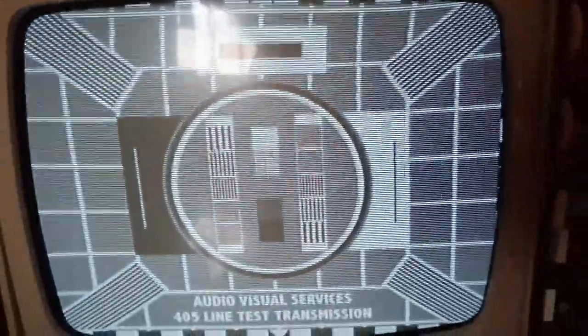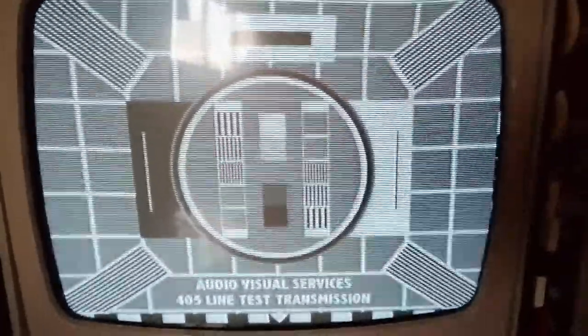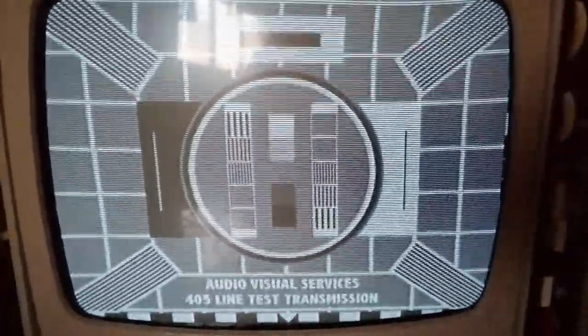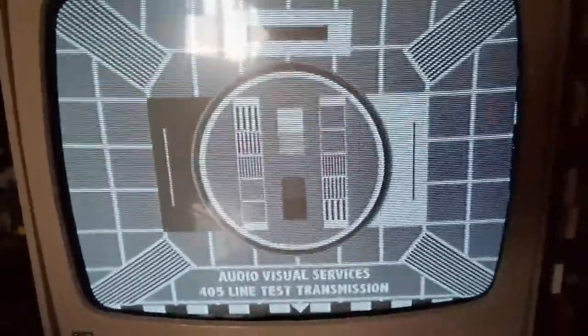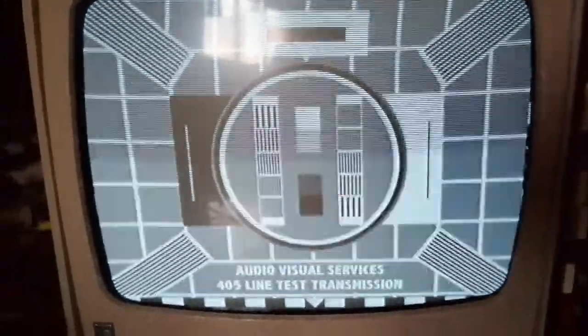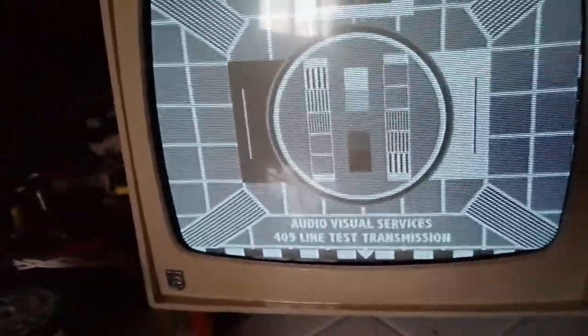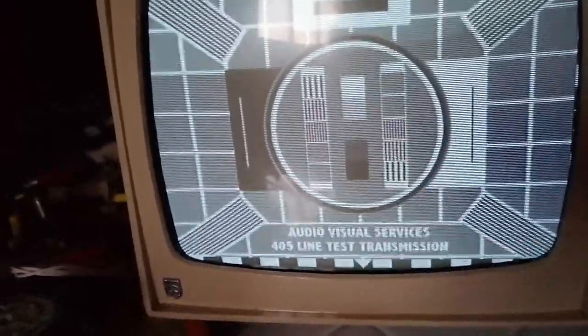The only other small change I made was the value of the choke on the oscillator which is now 470 microhenry. And there's a small choke on the input to the grid of 470 microhenry as well. If you look at the grid on the scope, we can see there's a little RF bleeding from the oscillator back into the grid.